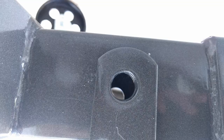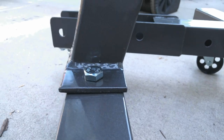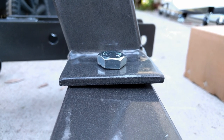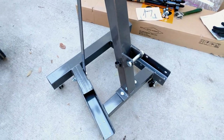Another issue is with the fit between the column and the struts. Either the struts are too short or the column base is fabricated at the wrong angle. In order to get all the pieces to fit, the base is slightly tilted, forming a hinge between the column and the base. These are two of the most important components in the system, and they have to be forced together to fit — and even then, they barely do.